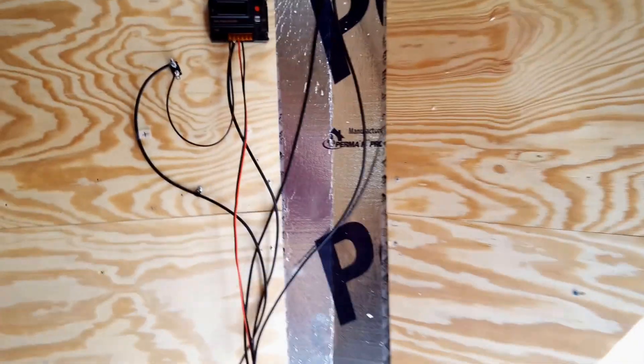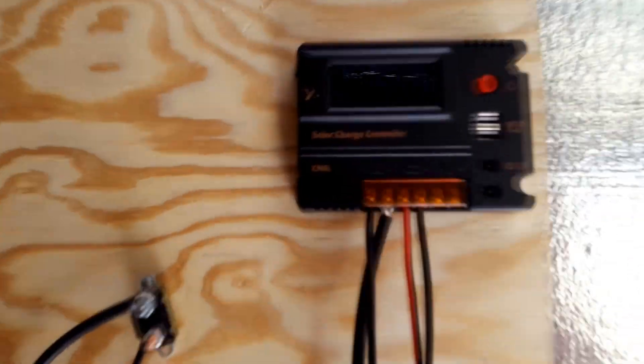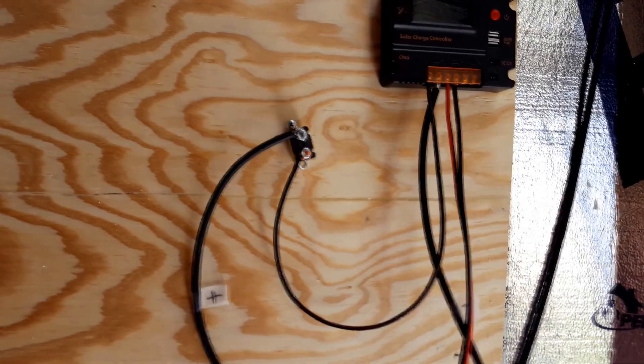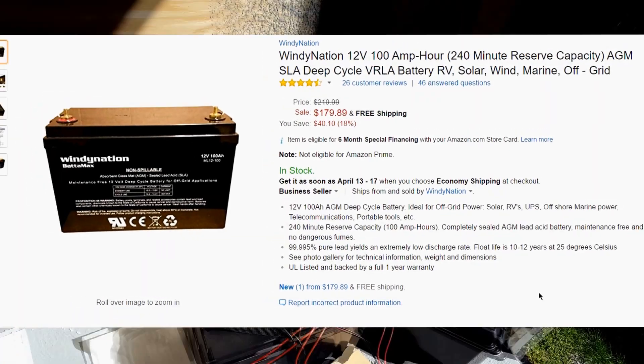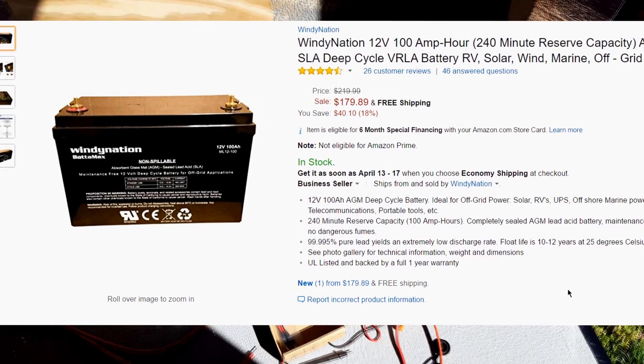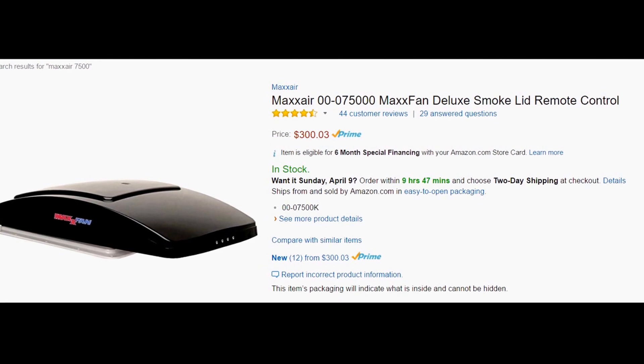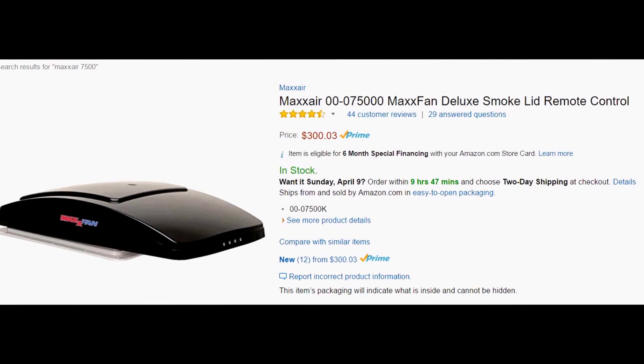Today I got the simple version of the solar setup. That is the charge controller that I've got going right now, bringing in 9.2 amps, 14.7 volts is what the battery is at. I just put a 20 amp resettable breaker on there. It's going down to — I think it's a Windy Nation battery, 100 amp hour. And then one comes back over, goes to the fan.